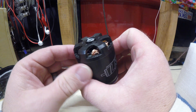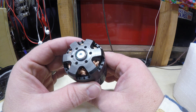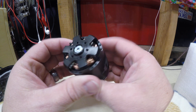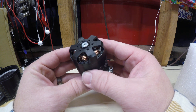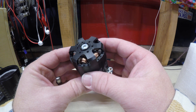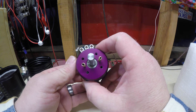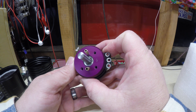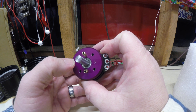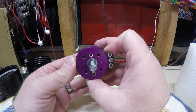You can see inside there the twisted pairs of copper wire. What's also nice, you can see this motor's been dynamically balanced. You can see the set screws right there, which they use for balancing the rotor. This is a 5-wind, which turns out to be about 1133 KV under load. It's a 4x30mm bolt pattern, M4 screws.